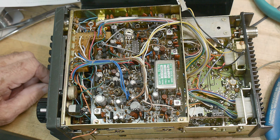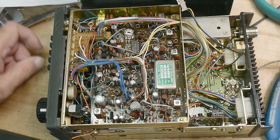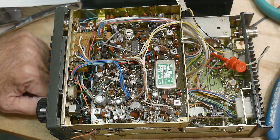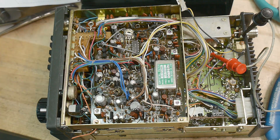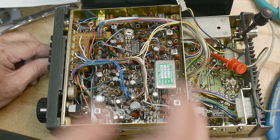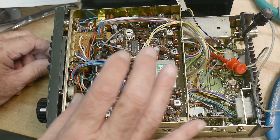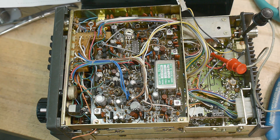When I got it, it had no speaker and no power connector, so I figured out where the power comes in. I put a clip lead on the positive 13.8V rail and ground. I hooked it up — and we can hear static! I'll turn the volume down. The squelch circuit makes it quiet, so squelch and volume both seem to work. That's good.